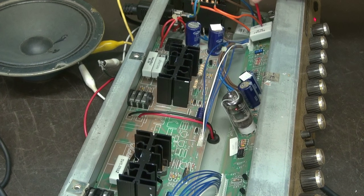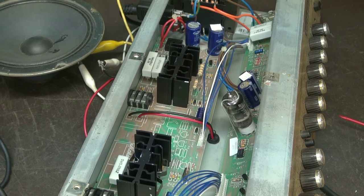Hear it? These resistors — the leads have fatigued and the solder connections are bad. So to repair it, unfortunately I'm going to have to take all the knobs off, all the nuts, that and the other thing, and pull the board out. Let's flip it upside down and take a look at those connections.